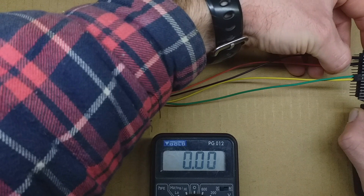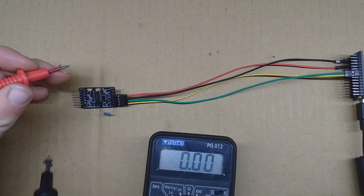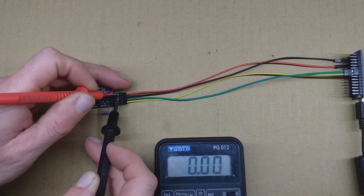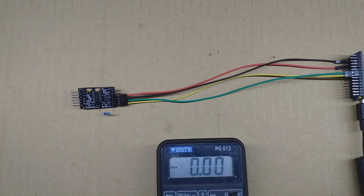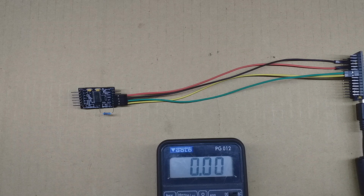So let's put this on to 5 volts. We have 5 volts coming onto the board — around 4.7 volts — and the excitation voltage should be around 4.3 volts. In that scenario, the onboard regulator is used and should work fine for getting as clean a data signal as you can.